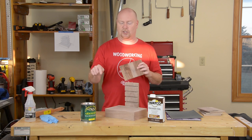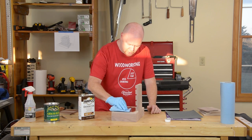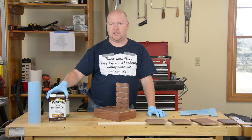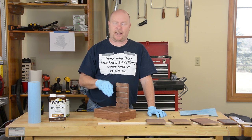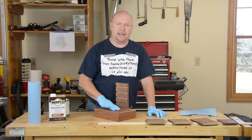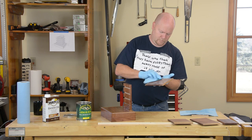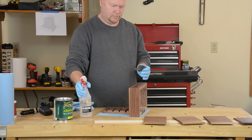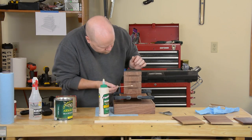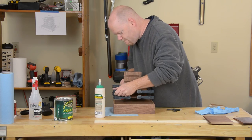It's been a couple of days, so I have two good solid coats on here. The first one I just let soak in, and the second one I sanded with 400-grit wet/dry paper to do a pore fill, and I have a glass-smooth surface as a result. I find wipe-on varnishes to be about the easiest to get on evenly, especially with the raking video light I have available. Once that coat was dry, I came back with mineral spirits and steel wool and smoothed it back down to that glass surface I had after the pore fill. With the first coat on there, I could do the final glue-up and get the shelves in, since I didn't want to do final finish before assembly in case I dinged it up with the clamps.